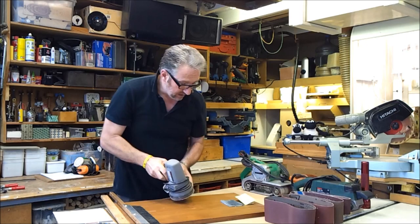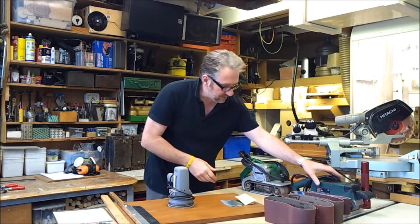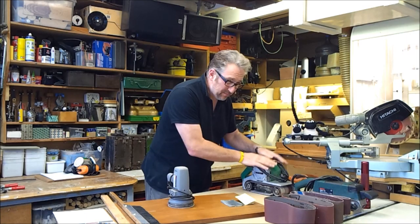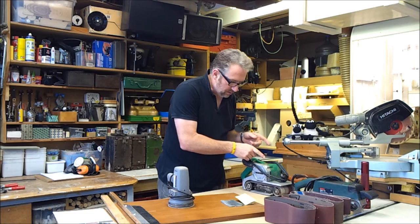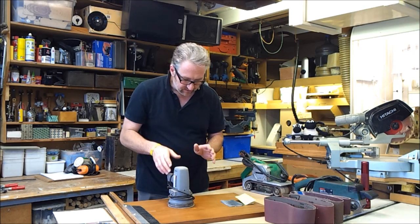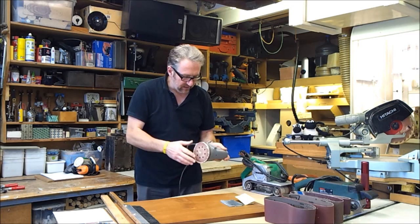From that shop you may well have borrowed something like this — an orbital sander. Orbital sanders are one of many different types of power sander, and an orbital sander is a moderate tool in terms of its sanding ability. This type called a belt sander — I have two different varieties here — a three-inch belt sander and a four-inch or one-hundred-millimetre belt sander. They're a pretty serious tool to be honest; they take much more material away but in a more aggressive way, so they do take a little bit of handling.